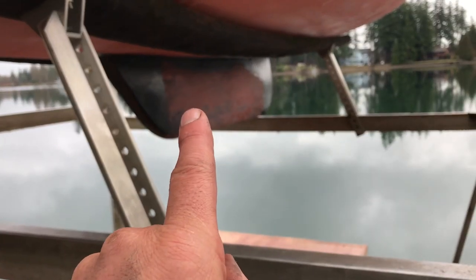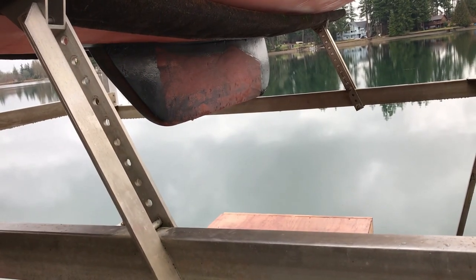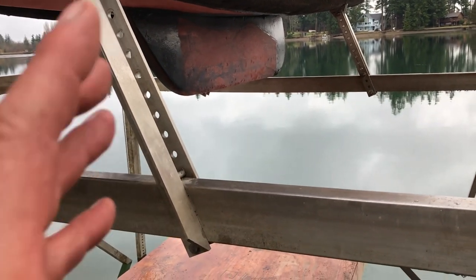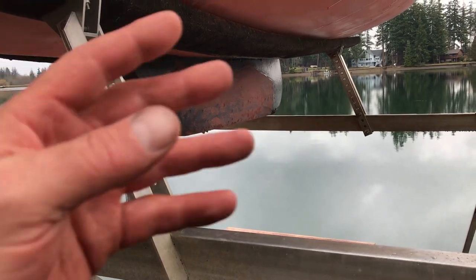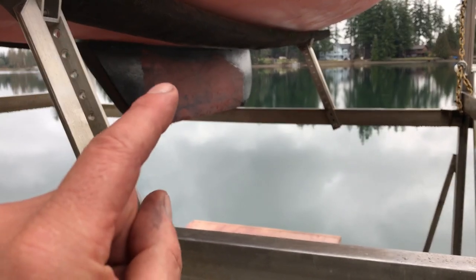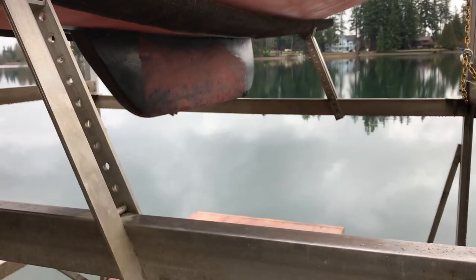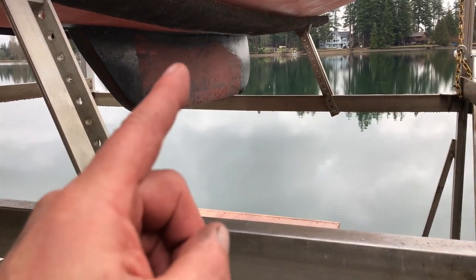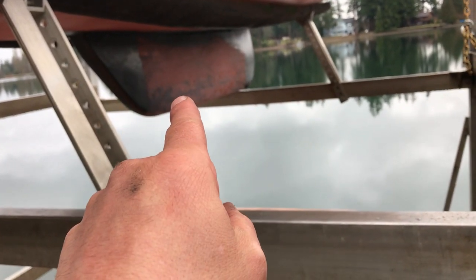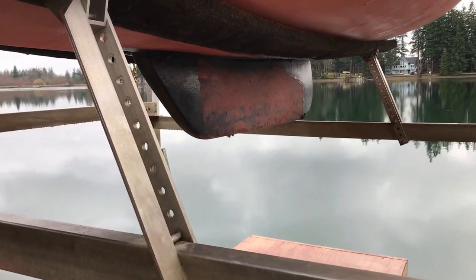Now, my keel is cast iron, and the boat, of course, is fiberglass. Typical bottom paint that is used on boats out in the ocean is a cuprous oxide. It has a high content of copper in it, like 40% copper. And the copper keeps the growth away. But I don't want to use copper because my keel is metal. If I use a copper-based bottom paint, my keel might corrode, unless I've got lots of coats of epoxy on there beforehand, and I don't know exactly what's on there. And I did sand it down in a few spots to the base layer and possibly some metal in some spots. So I wanted a non-copper based paint.